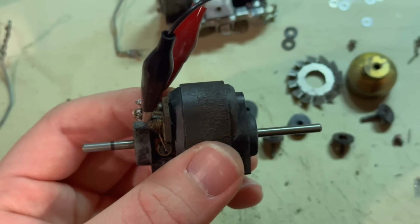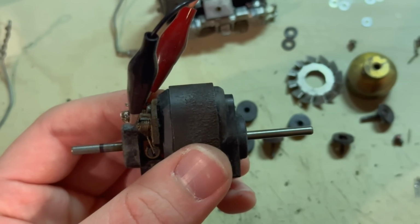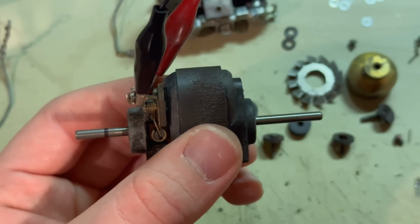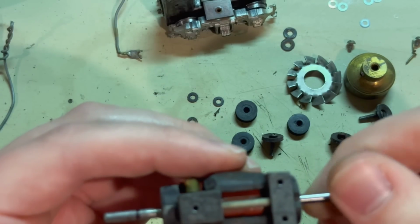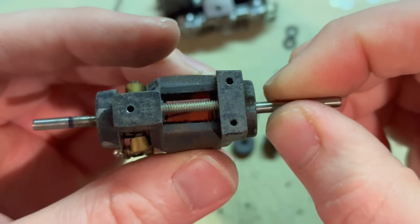So going free, that's about 0.4 amps. It's very smooth. I feel almost no vibration at all from this. So that's really some top-notch engineering to put this together. And even at the lower speeds, it felt nice and smooth because of that 7-pole skewed armature.